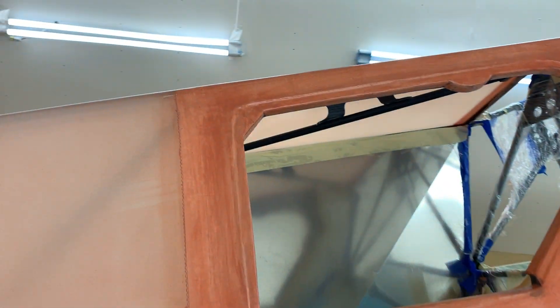If you keep trying to work it in as the poly brush sets up, all you'll end up with is streaks and edges. The secret with poly brush is to get it on there, spread it out, and get out of there. Leave it alone. Once it's smooth, leave it. Don't let it start drying on you. This is a very important area here because you're going to see it.